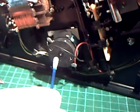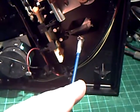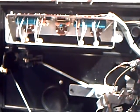Same sort of control module is used as before for the electronic motor control. There's your little motor. It's almost identical in some of them to the motors found in the earlier cassette decks like this, especially the EL3302 and the like. But somebody has been in here before me as well, because there's a blob of solder there that really oughtn't to be there. And I wonder if the power amp perhaps went before and somebody's had it apart and put in a replacement. But if they did, it's not from a 603 because the 603 had sliders rather than rotary controls.